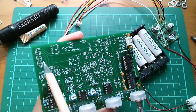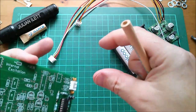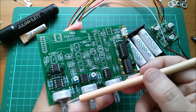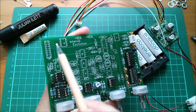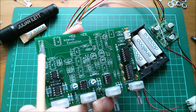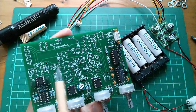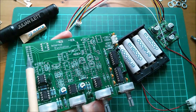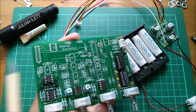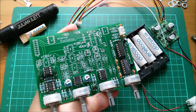I think the ribbon cable will then match the filter boards to this excitation board. I also had to set the distance from the front panel to the connector on the filter boards exactly the same as on this board, so there won't be any distortions or misplacements in the ribbon cable. It's going to be very interesting when I get the filter boards and start making up this ribbon cable which distributes signals to all of them. But for the moment, that's it — cheerio.